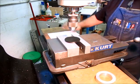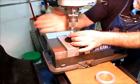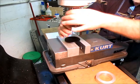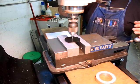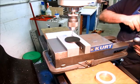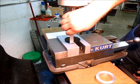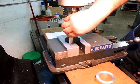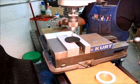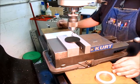All right, so we got our coordinates here. And how thick is that? It's about 1/4 inch, so I think I'm just going to touch off and drill that down to about 1/4 inch.